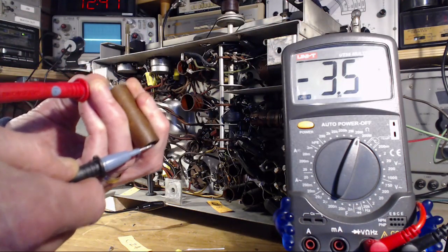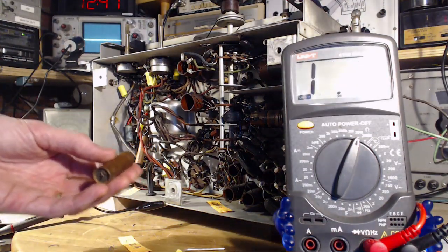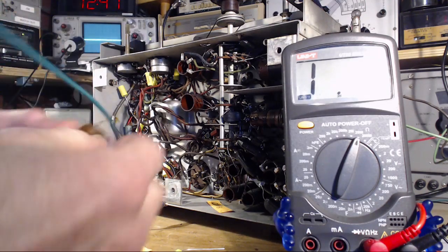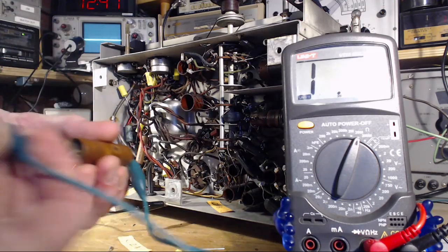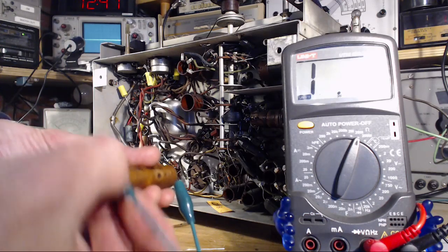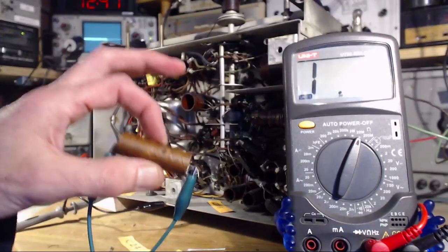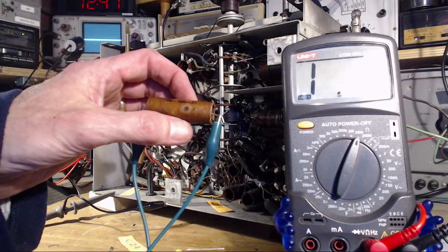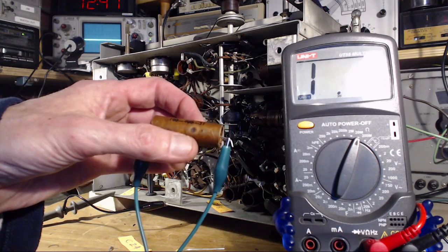So it's carrying some voltage. Hey, here's another test we're going to do now. We're going to put a short circuit on this. We're going to test to see if this capacitor has turned into a little battery. A very crappy battery. So I want to ground it out so any residual charge is dissipated, although because the capacitor is leaky inside, it self-dissipates. I just want to be sure.